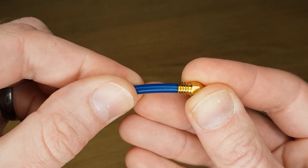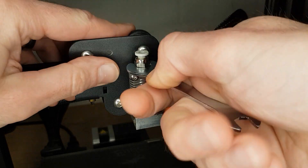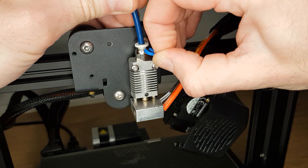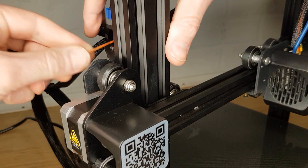It is very important that you cut the ends as square as possible. If the end pushing up to the back of the nozzle isn't square, you'll leave a void which can fill with filament and give you issues with stringing and clogs. The kit I've linked below comes with a special cutter which helps you get the end nice and square. It also comes with replacement pneumatic fittings which are better than the standard Creality ones. Now refit the nozzle but leave it one full turn from being tight. Push the new Bowden tube down through the pneumatic fitting into the still hot hotend until it pushes up against the back of the nozzle. Attach the retaining clip, then tighten the nozzle the final turn. Assembling this way ensures there can be no gap behind your nozzle. Attach the extruder end by pushing firmly in and attaching the clip. You're now ready to feed your filament back in and get printing.